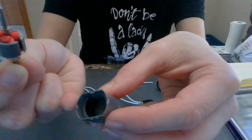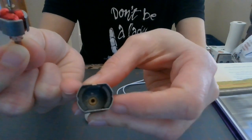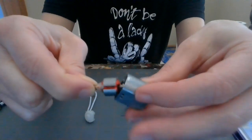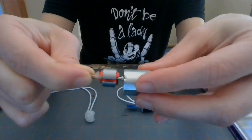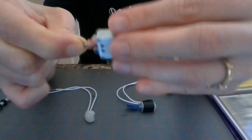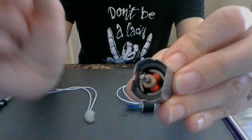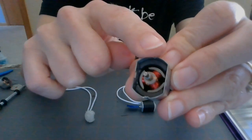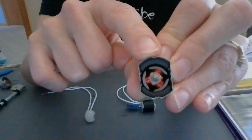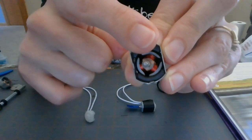What do you think those are in there? Those are permanent magnets. You can see the metal of this part gets pulled to the sides. The permanent magnets on the sides are curved and are interacting with these metal cores that the wire is wrapped around.